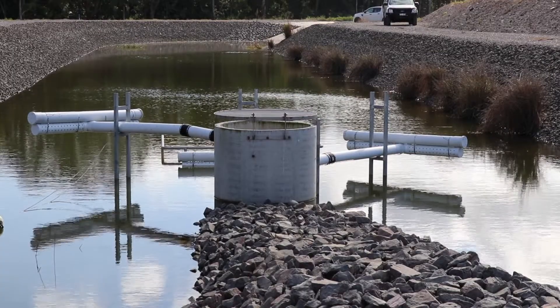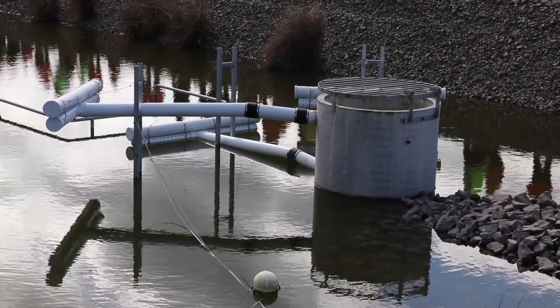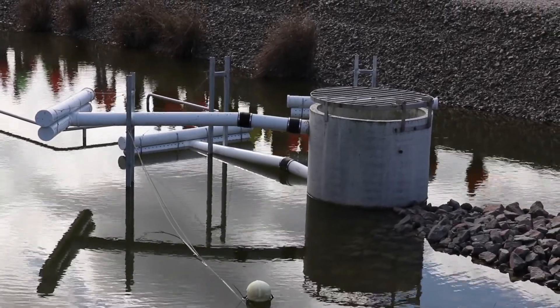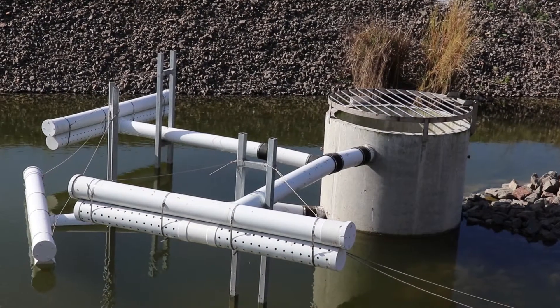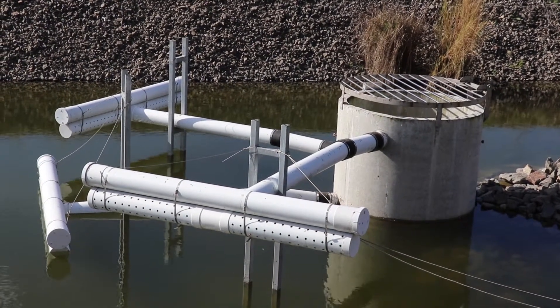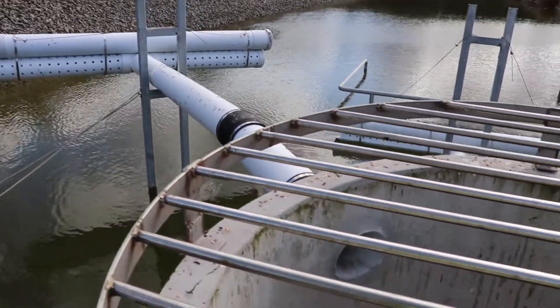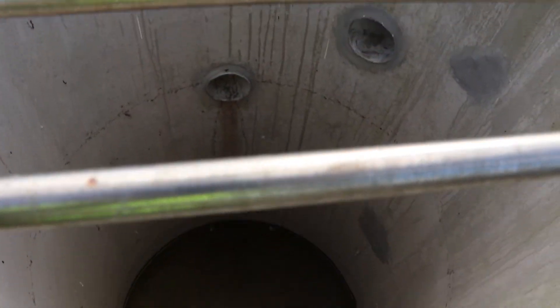Caloundra Landfill is one of the reasons we're going there — you'll see one of these, a permanent sophisticated one. They're T-bars that basically skim the clean water on top. There are PVC pipe screw caps on the end which act as the float. Underneath is another PVC pipe with holes drilled in it — the float keeps it up high and the holes are where it starts to drain through. We generally have three of these within a basin.